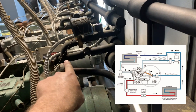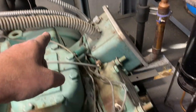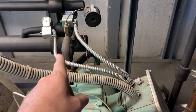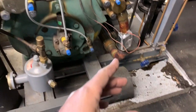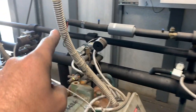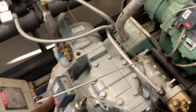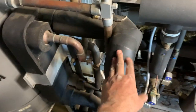The suction gas comes back and the liquid gets injected for demand cooling to keep the compressor cool — all coming into that intermediary discharge line back into the compressor. The expansion device element references the discharge line to start squirting refrigerant in. There are solenoid valves on everything to control it all. The suction header is on the bottom, also with a solenoid; the intermediary suction header is in the middle; and the top is your sub-cooled liquid, which tees off to everything. The main reason for all this is a lower overall compression ratio, which equals greater efficiency.